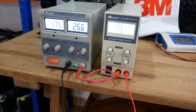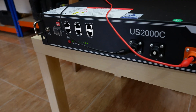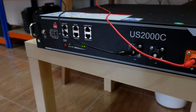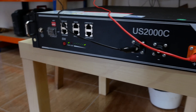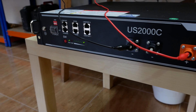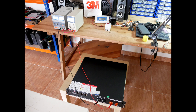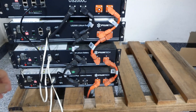Before I connect them to a working storage system to test it, I will pre-charge them for a while. This controlled charge procedure will also work as a preliminary test. Whenever possible, we should equalize the voltages of the new module and the system itself. Otherwise, if you have a charged system and a discharged module, when you connect the module you will get a rush of current from the charged system to the discharged battery, possibly even triggering the overcurrent protection. When the voltage of this module became close to the other batteries I had on a working system, I added the repaired battery to the pack.